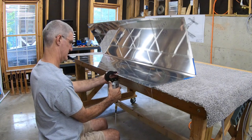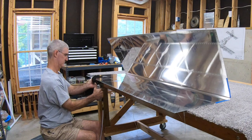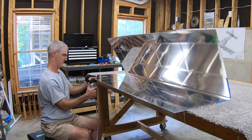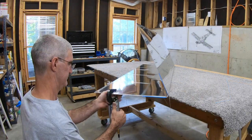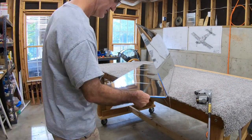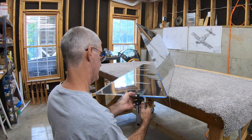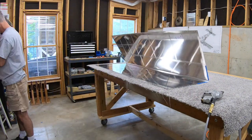With the three-inch yoke I can reach all the holes right along the edge of the skins and then about two holes in along each rib line or along the spar. If I switch out for the four-inch yoke I can reach one more hole, which quite frankly just isn't worth it. Right there I'm double-checking, making sure before I dimple the holes that are parallel and just inside of the taped-off fairing holes.